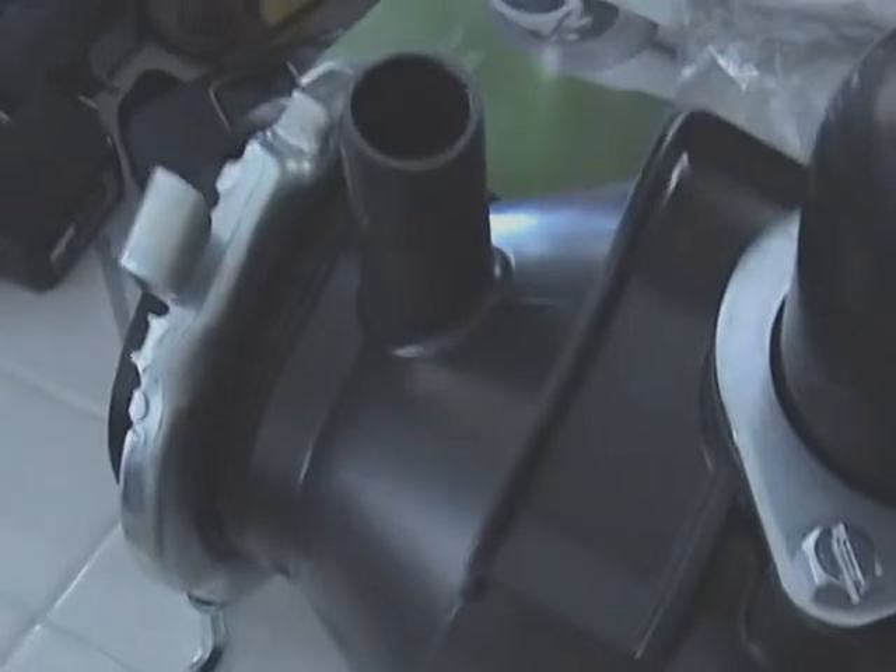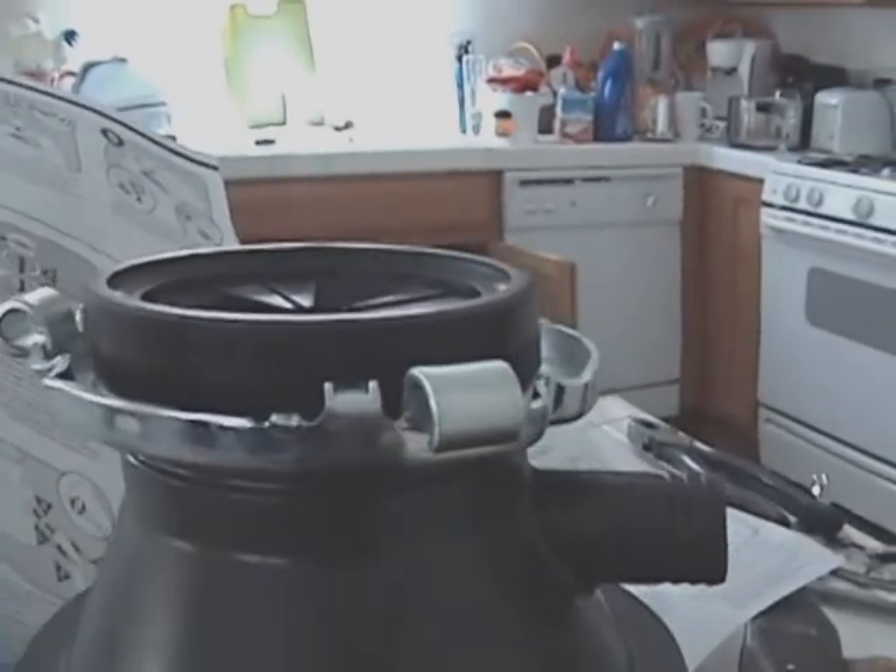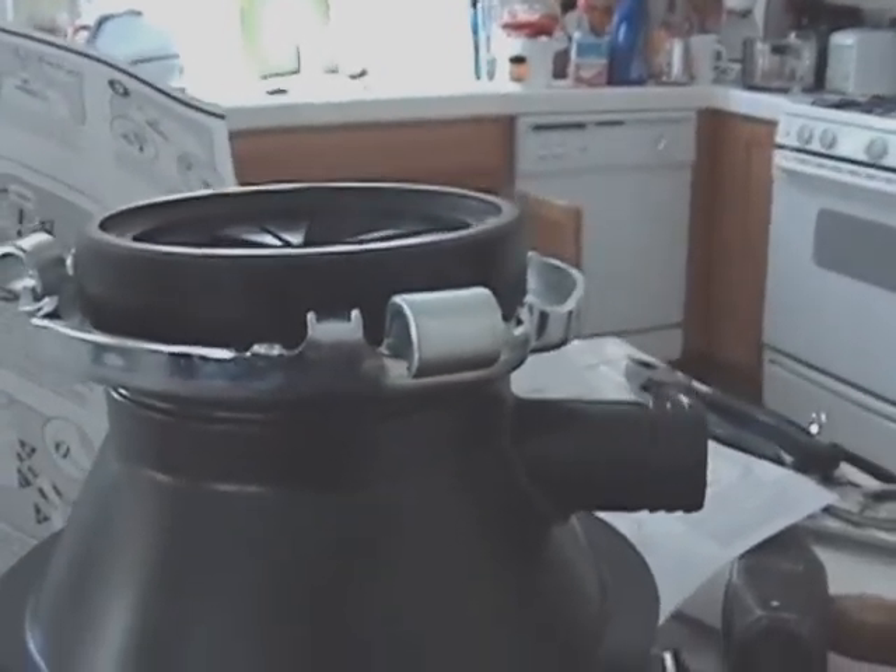Now, we'll go and install all the hardware again here. That's installed. Now we're going to tighten these three screws. They're tight. Good. Now we're going to knock out the dishwasher plug since we do need it. Remove it here. And now it's just a simple matter of putting them under the sink and sliding that to capture. It's installed.